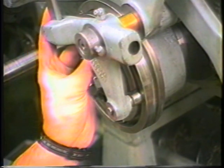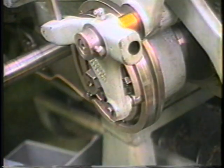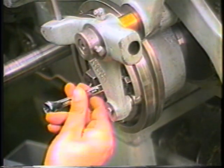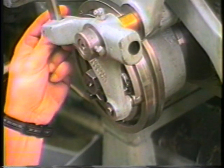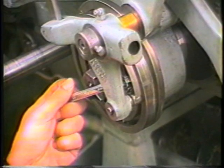The 1263-20-1 cam that closes the burring collet is now set above and against the roller on the burring spindle opening and closing cam lever. During machine operation the burring collet should not begin to close until after the spacer is tight against the stationary head.